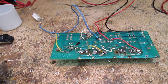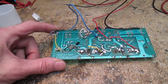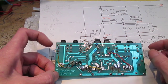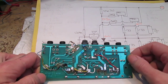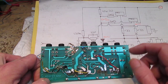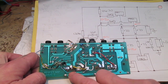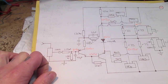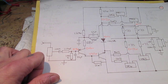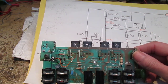so that's the amplifier. As you can see, it's in a bit of a state. I've been working on it pretty much every morning, the odd few hours here and there for a week. So the chaps have suggested that what could be happening is it's oscillating. What the chap suggested I do is get the good channel working and probe for oscillation. I did probe for parasitic oscillation earlier on when working on this board. At the moment I don't know what I'm going to do with that duff board, so I'm going to put this into its heatsink.